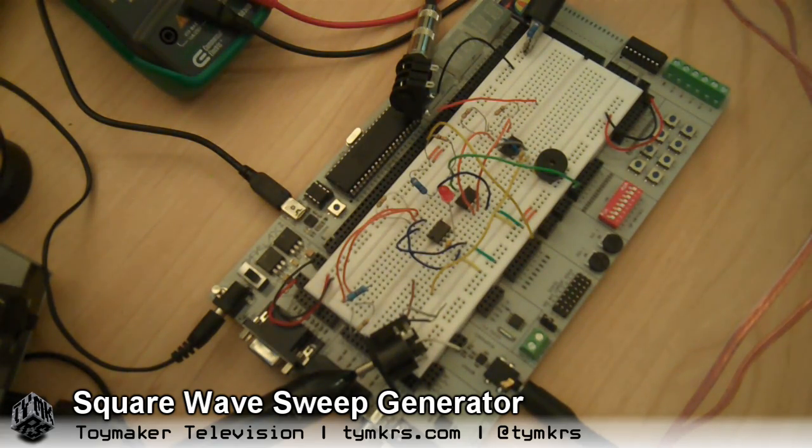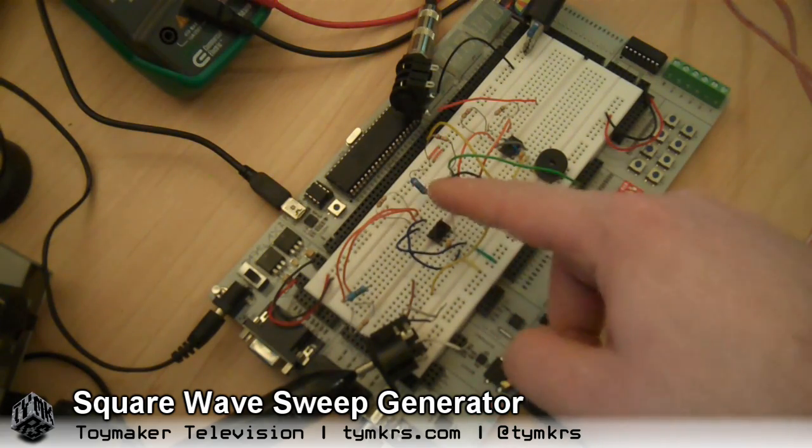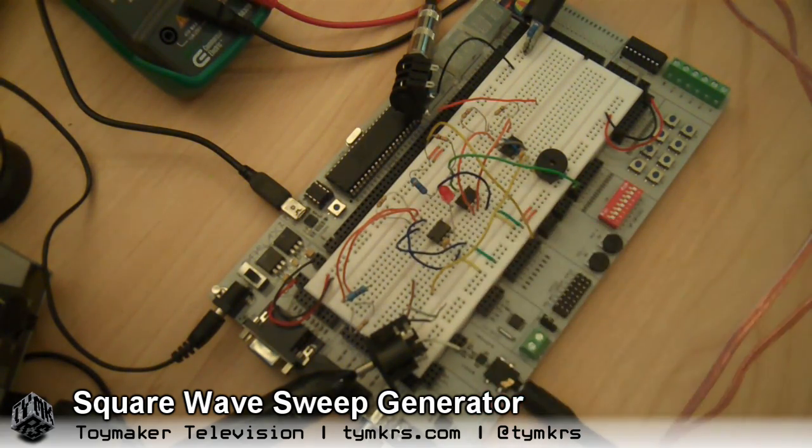Now when you first made this you actually had some issues with some of the 555 chips, right? My main problem was that I needed a diode between the output of the first 555 and the clock on the digital potentiometer — specifically this little guy right there. GRS Pruitt helped me figure that out — thanks Jason. Mark Vandewettering was there that night too. We figured it out on the live stream — always lots of fun. I think that covers it.